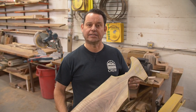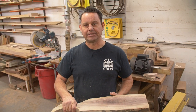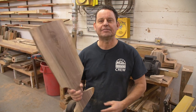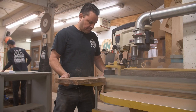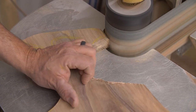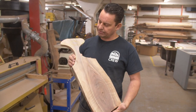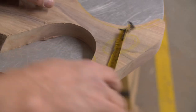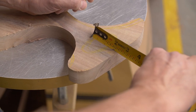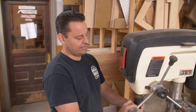Now we have a rough cut. We're going to take this to the sander and touch it up a little bit. It's important to have a nice grip — you want to be able to grip it with your hand. You don't want the handle to be too fat, and you don't want it to be too skinny or it will snap under the weight of the board. We've sanded our handle and it's nice and round and smooth. Next we're going to punch a hole in here so you can hang it — I'm thinking about an inch and a half to an inch and three-quarters. I like to use the Forstner bits because they cut better than the alternative, which is the hole saw.